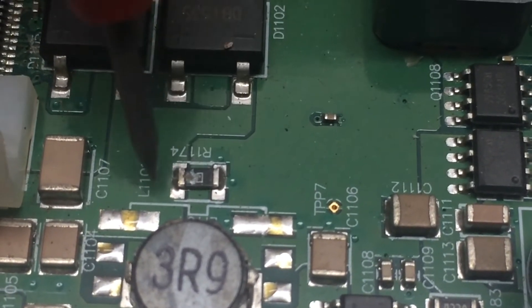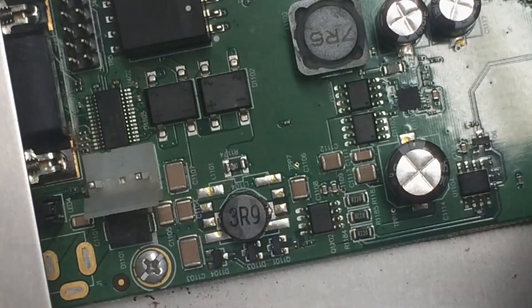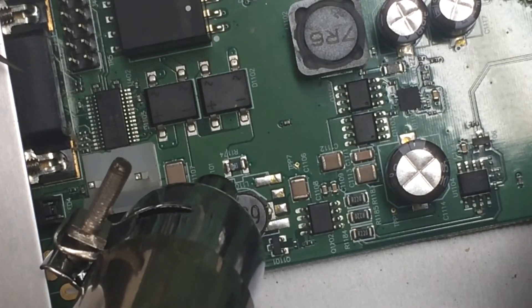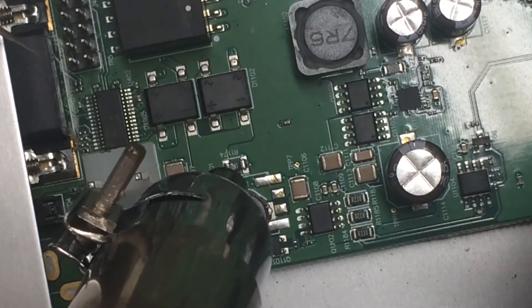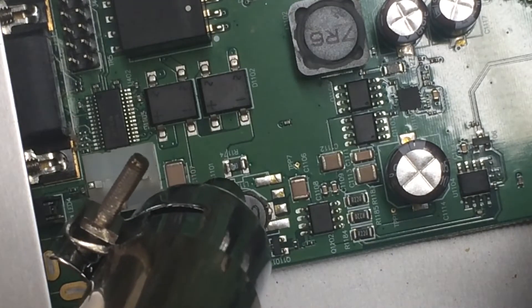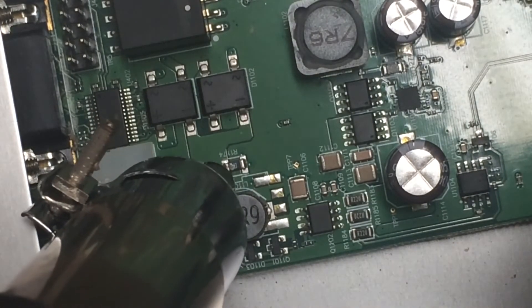What I'm going to do is heat this resistor up with the hot air gun, pull it out, and put a jumper in there — that's going to make this unit functional again. I'm just heating this up with the hot air. This is a really cheap hot air station that I bought — you can get them on eBay for about 50 bucks — and it comes in really handy.